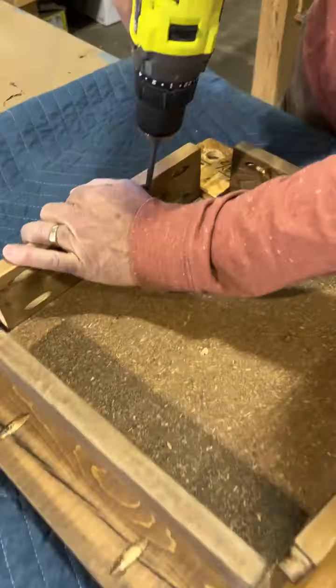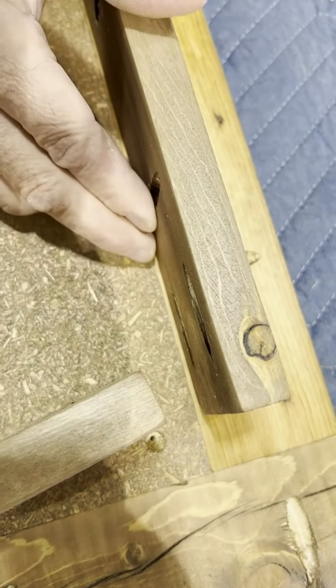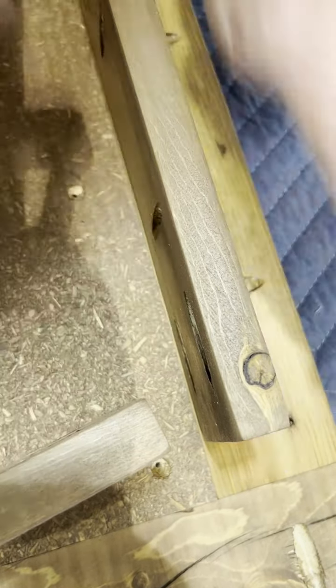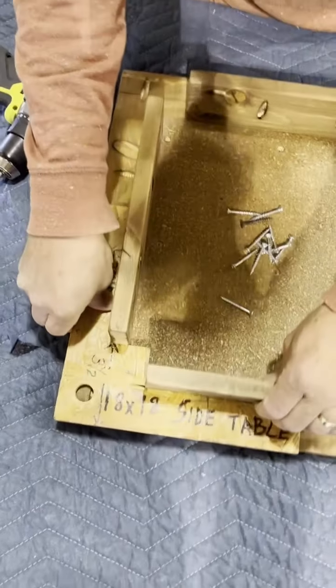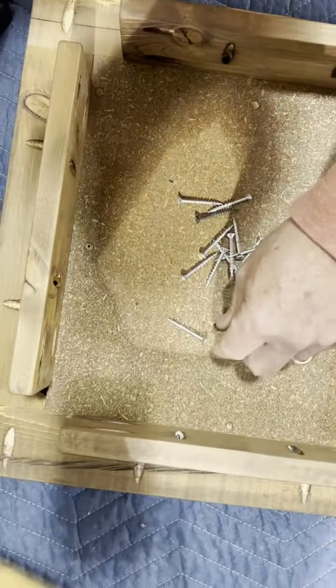It helps when the apron is flipped around the correct way. If you look closely, the inside of the apron is pretty much flush with the inside edge of my top exterior, so all I really need to do is follow along that line. I don't even need the jig anymore — I can just flush it up and use that as my guide, centering from left to right and staying parallel to my top.